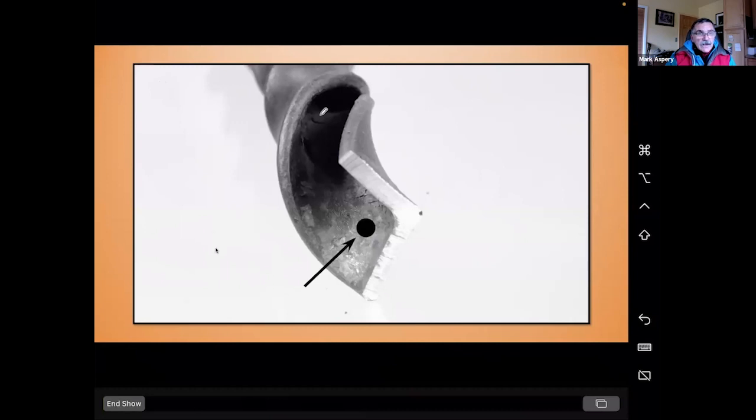The other thing I want you to know about twisting angle iron is that the more you twist it, the more the edges deflect. So if you look at the top left, you can see this is almost a flying W. Everything is even. Those edges have really been deflected. And you can see by the bottom right photograph that I'm only just a little twist away from this bit of bar actually being twisted next to the parent bar. So it doesn't take much for this thing to get out of its own way.